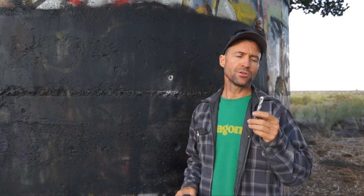To start, we need a good, proper-size hole. You need to make sure you've got the proper size bit. This is a 12 millimeter SDS bit. I've drilled one hole with this, so I know it's sharp. The shoulders on this bit are in good shape, which means I'm going to get a proper diameter hole. As these bits wear down in hard stone — and they can wear down really quickly — the carbide shoulders wear down, the holes get tighter, and people call me up saying their bolts won't go in. If you're having problems driving your bolts in, that could be one of the issues, or maybe the holes aren't cleaned properly.